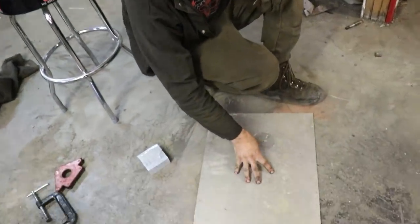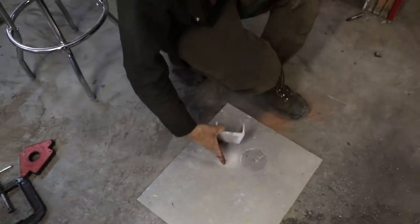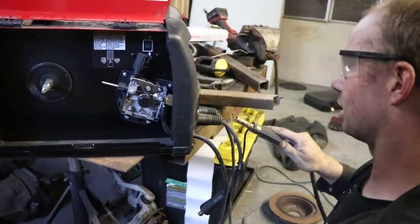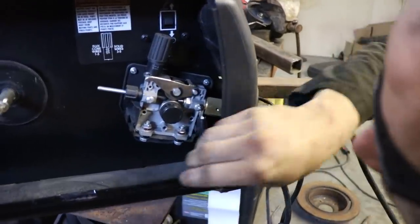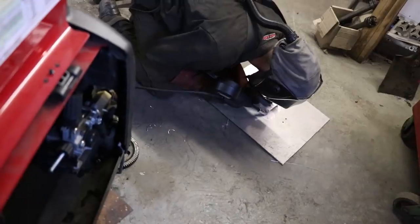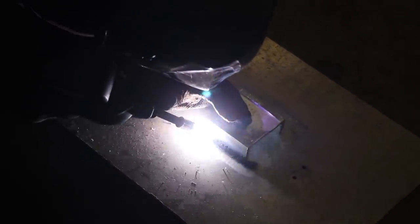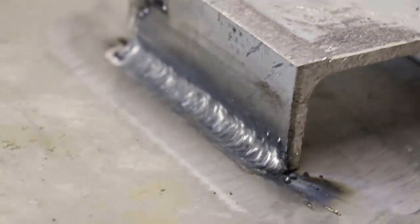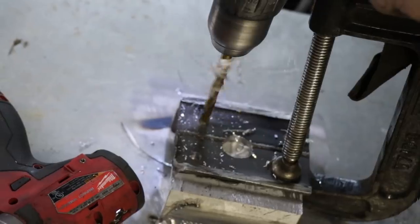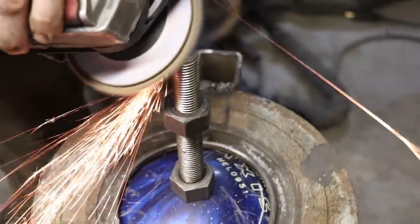This is another sheet of aluminum I just got from V&R — fairly thick, but I want to go with aluminum because it's light. I'm gonna clean this up, pop the I-beam on there, and just weld it. There's a spool gun attachment you can get for the 140 so it'll actually do aluminum as well. For aluminum we do need 100% argon, otherwise the welds are gonna look pretty poor. I'm gonna take this plate and weld it to the top, drill four holes, and bolt that to the table — and we're almost there.